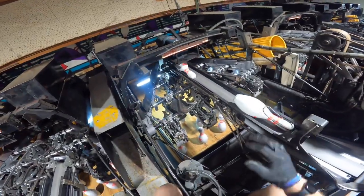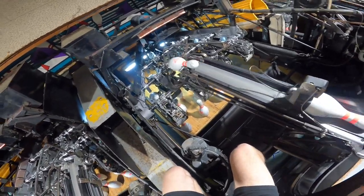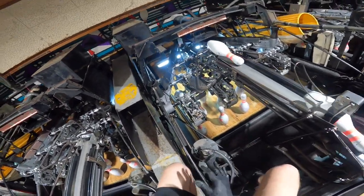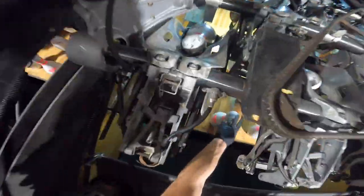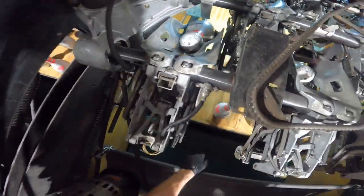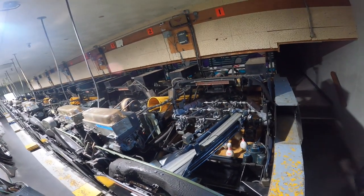It's definitely a lot better than it was after we replaced that grease fitting. Little stuff like that — I wouldn't worry too much; that should be fine. As long as when it sets your pins they're not wobbling like they were before, because that's what causes reset cycle issues sometimes.